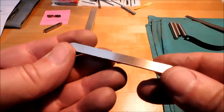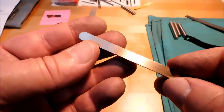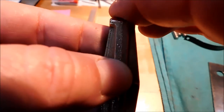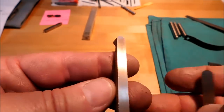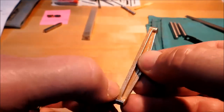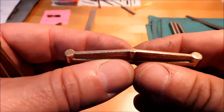After a couple of minutes of swiping these across 150 and then 220 emery, I got a nice flat bottom. To check flatness, pack them together and block the light out — try to look through. If no light is coming through the crack and they don't rock or spin on the surface plate, that's a win. I filed with the original draft of the casting to keep the look on both ends. Now we break the edge off ever so slightly, flip it over, break the edge off on the other side for parallel, and then simply drill and spot face the holes.